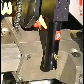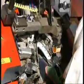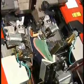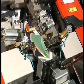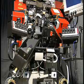An optical compass projects luminous lines onto the toe of the shoe, making it easier to center the upper. Sincron Zero was designed to make operation easier. To give workers a wider field of vision, the pressing button is positioned on the right when in operation. At the end of the cycle, the shoe falls into the basket.